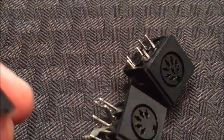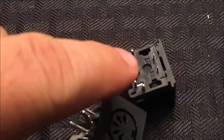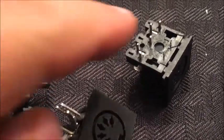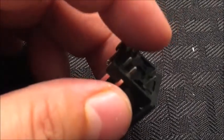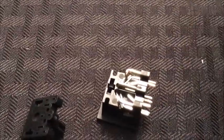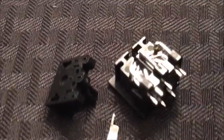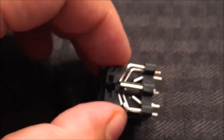What I did is remove the bottom of the 8-pin connector — this is it. It didn't have these two extra pins that you can see in the front, so I just took the bottom of the 5-pin out and swapped it over. The other thing you have to do is deal with the extra three pins, because they're not actually going to the board. The board doesn't have the holes for these three pins, so you have to take some wire cutters like this and snip off the parts that protrude from the bottom.